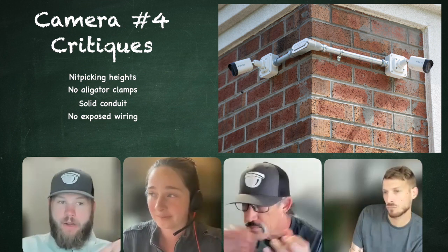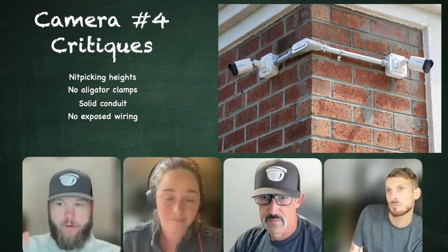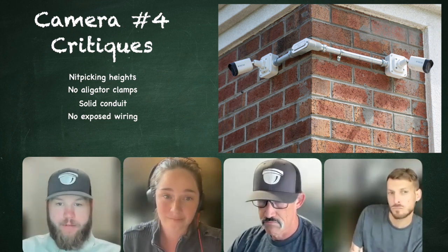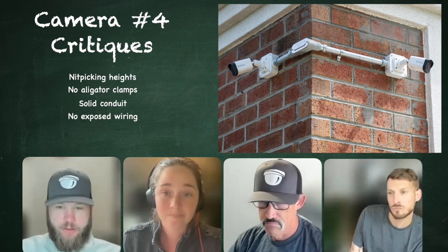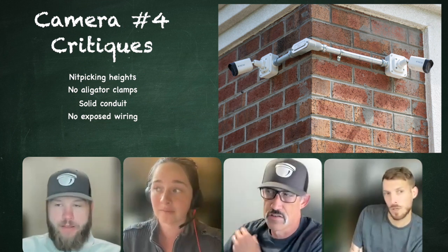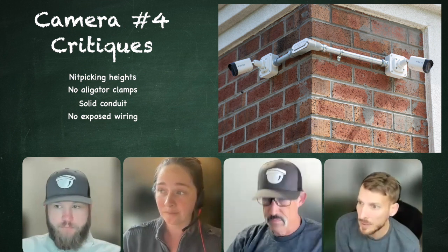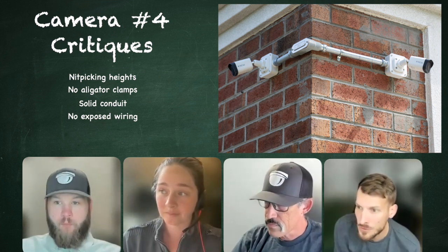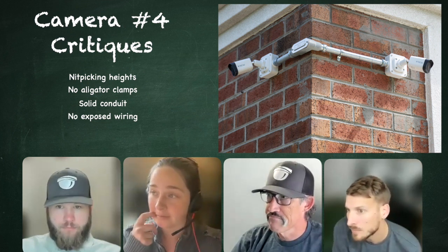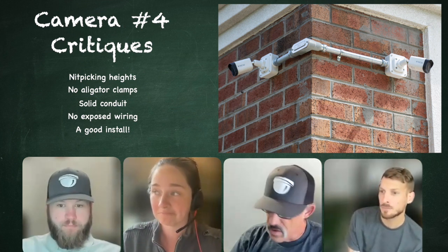So just to be clear, there's most likely one hole going into that LB pull-through, and that's one of the reasons why you do that, so you don't have to put quite as many exterior holes on the building. So instead of having 2 of them, we've only got 1. Which is a good way to do it. And the longer piece of conduit has a 1-hole strap in the middle, properly supported. This looks really, really good compared to the last couple.